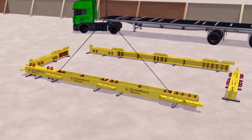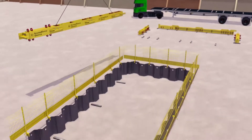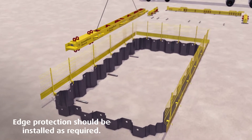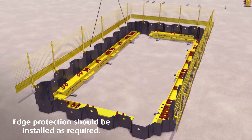Mega Brace is generally used in conjunction with pre-driven sheets and piles. Using a certified lifting chain, attach the hook to the red painted lifting eyes and lower the individual legs into the base of the excavation onto level timber bearers.